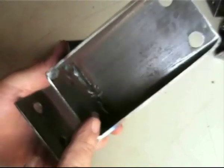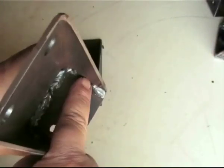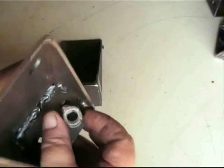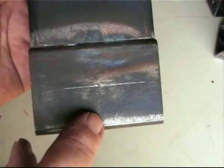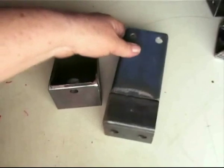When you do the welding on the smaller wedge, it is important that you leave a break in the welding bead adjacent to the holes, so that a nut has sufficient room to be turned and tightened in place. At this stage or prior, you will need to drill a small pilot hole in the centre on the back face of the channel. The reason for this will be explained at a later stage.